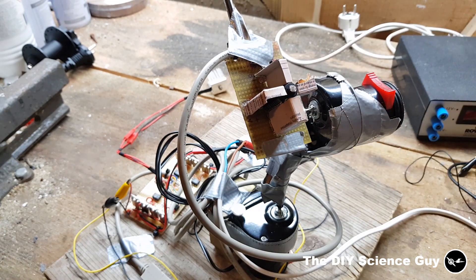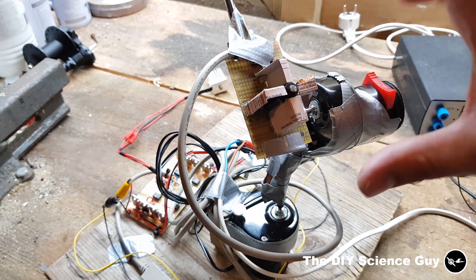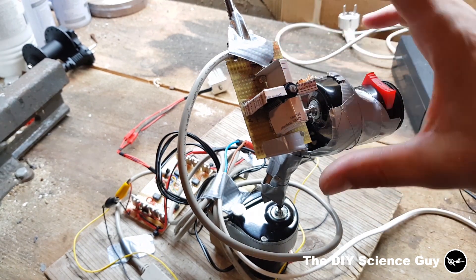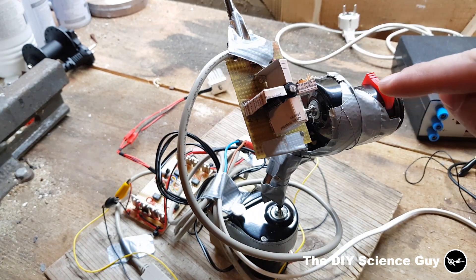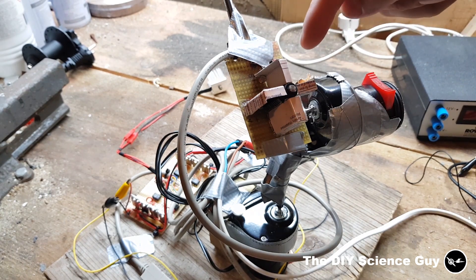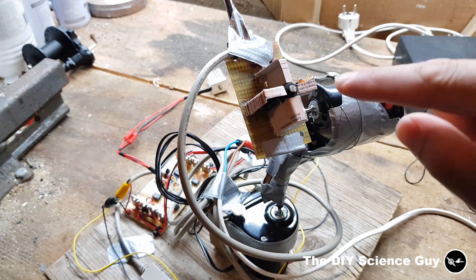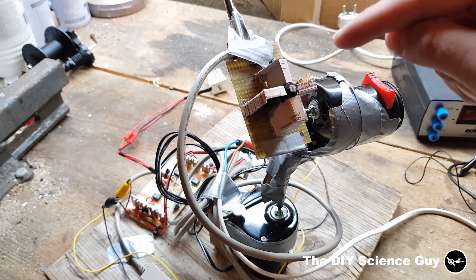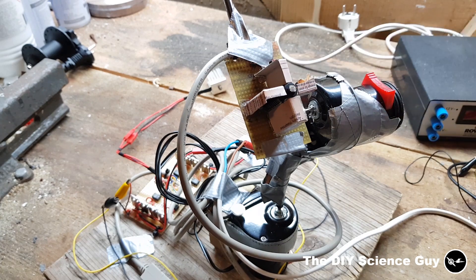These pieces of cardboard, which create a shadow, are of course temporary. I made them from cardboard so I can change the accuracy. Because if the shadows are too wide, then you will have a lot of hysteresis — it will juggle between two positions if you move your light from one side to the other. Because then you would first have a moment where the shadows would move, and then there will be light on that side, and then it corrects. And if you then move back, it will take a while before the light hits this side, and therefore it will be a little less accurate. So this way, when it's cardboard, I can still tweak that a little.